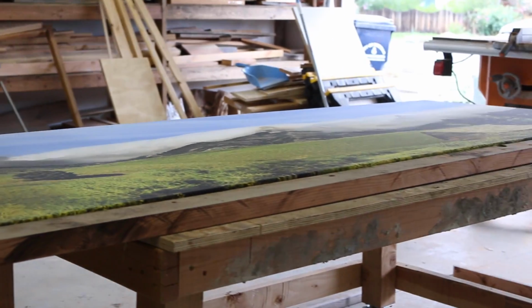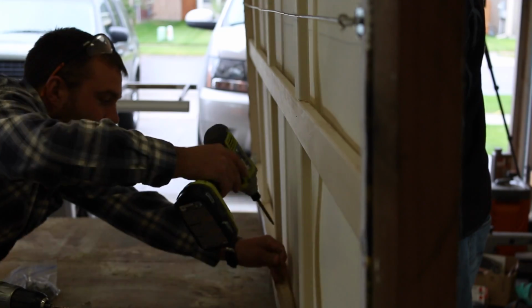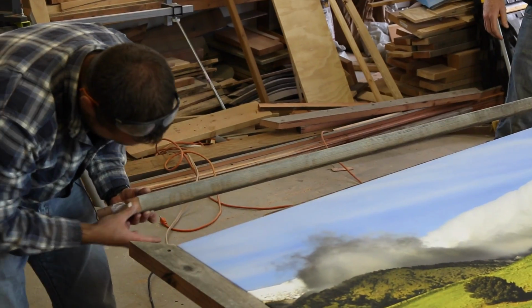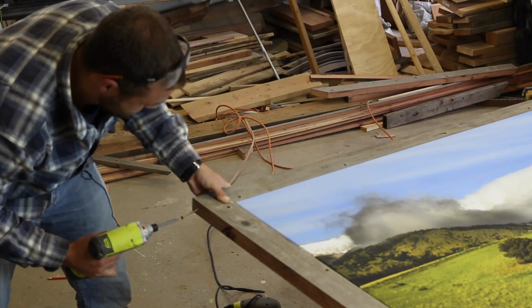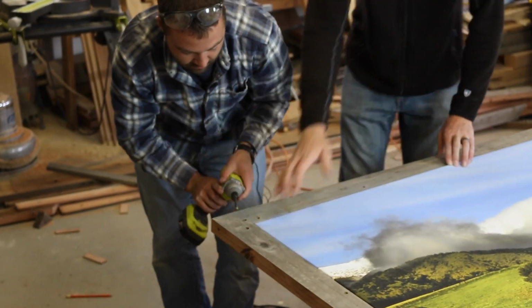and is square. Attach the boards to the canvas using about 2.5-inch long wood screws from the actual canvas frame to the larger frame we are creating. As you move around each corner, continue to glue, pre-drill, and then attach the corners with wood screws. You can wipe away any excess glue as needed using a damp rag.